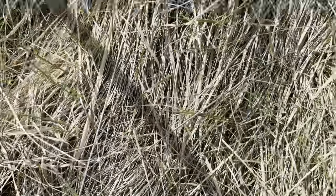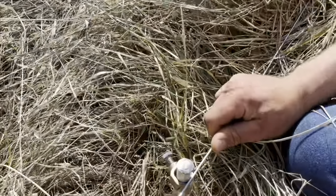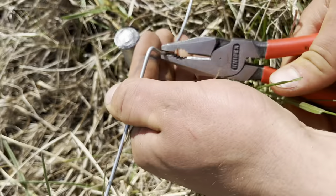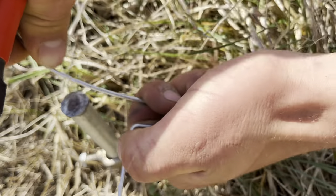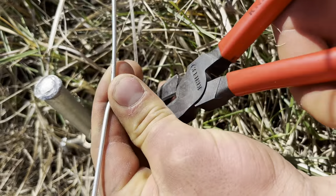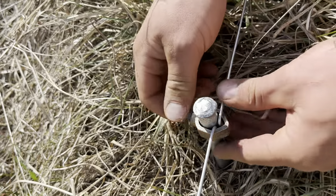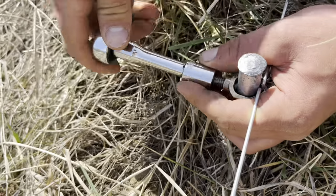There's one rod — you kind of stay low because the wind is just going crazy out here, but we've got these big old cedars acting as a nice windbreak. Now you've got your distance, and I've got slack on this side so I want this to turn down right there — I'll make a bend in that. Make that turn back on itself, because all you need is enough to go behind that clamp and back on itself. Now push them together — folks, this is all 12 gauge high tensile 170,000 PSI high tensile electric galvanized wire — and that should just slide right down in there and be tight.